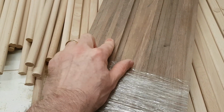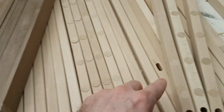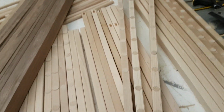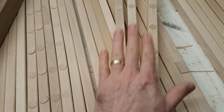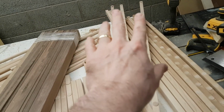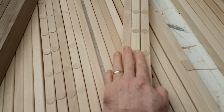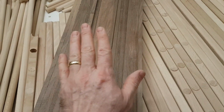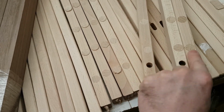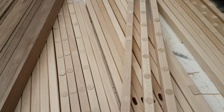So I'm going to add 2 of these strips, probably 3, because I'll have to add on pieces to make the length, which will be perfectly okay, because remember, the neck is strengthened with a truss rod. Well, in a Rickenbacker it's a double truss rod. So I'm going to now use these 2 and a couple of these walnut pieces in the middle.